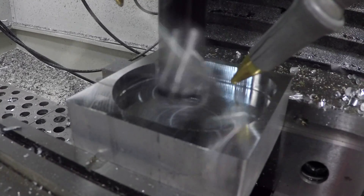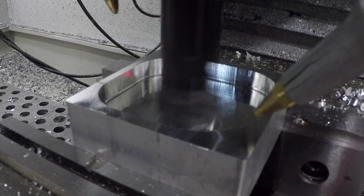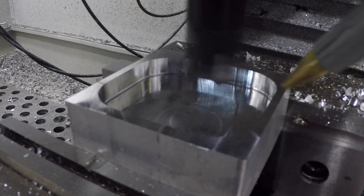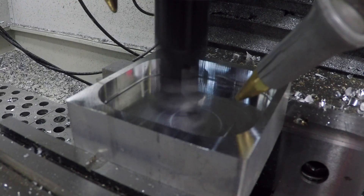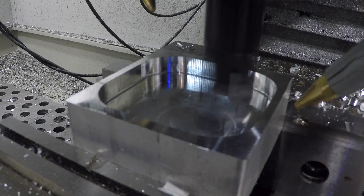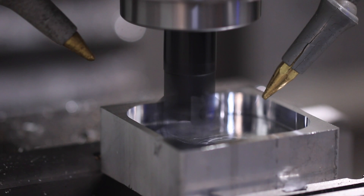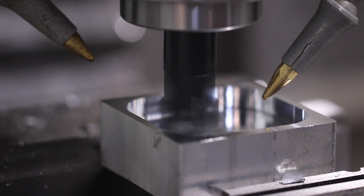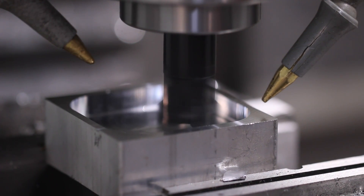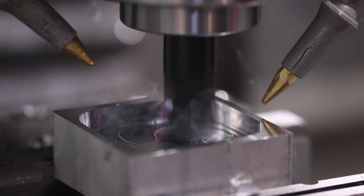It doesn't leave a perfect bottom finish because of the angle of the cutter, but it's more than worth it because it removes material so quickly. I love the fact that it's just not going to chip load. Even my roughing end mill, my half inch, you can chip weld or chip load that tool. The nature of the Shear Hog is just perfect — it's an insert end mill, so you get two cutting edges per insert and you can buy new inserts. It's rigid and can cut deep lengths of cut. If I sound like a fanboy, it's because I am.